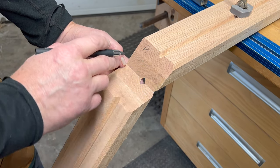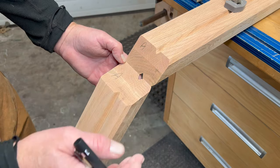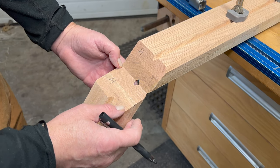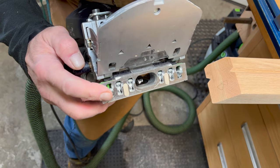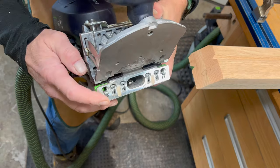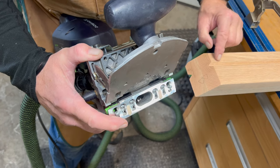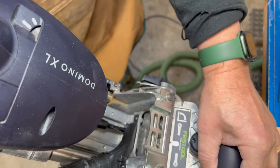I'm going to domino the miters here. I need two left miters and two right miters altogether. The miter return is going to be roughly three and a half inches back from the point, so I'm marking these to make sure I put the domino hole in the right spot. I'm using the detents on the machine to ensure that when I do my domino hole, I've got one at the bottom of the rail. The miter will be done one way and the main piece of railing on the other side, so as long as I keep the detents to the bottom and the groove near the top, these pieces will fit.